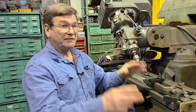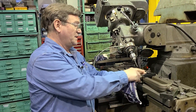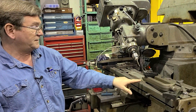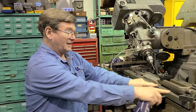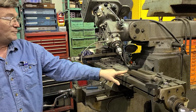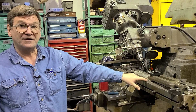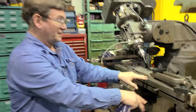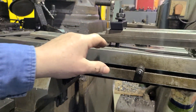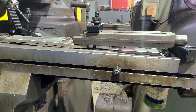General procedure: the best thing is to put your clamp — put your hold-down bolt — as close to the part as you can. Now you see where we don't have any leverage here, we've got a lot of leverage advantage here, it would be hard to bend the table with that close to your part. You get a lot more clamping force, and there's not that much it can bend in that small space.